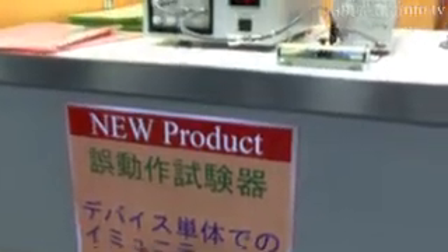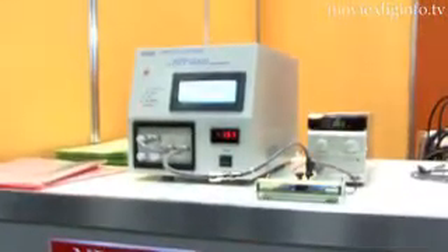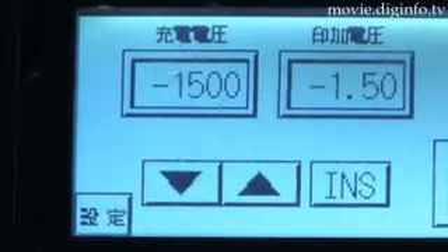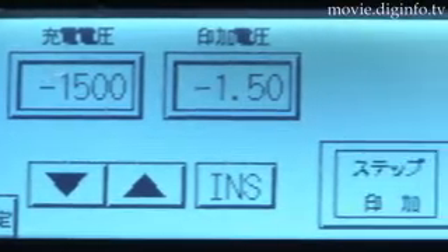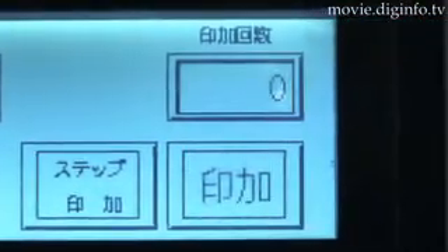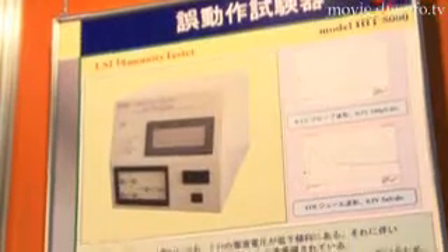Normally, when an impulse is applied with an electrostatic discharge gun, the power supply voltage noise that appears on the LSI pins may at times form an oscillating waveform, even when the impulse is applied with a positive discharge. Particularly in cases where the malfunction threshold values in the positive and negative directions differ, it is possible that malfunction could occur due to values that exceed the negative direction threshold, even if a positive discharge is applied.